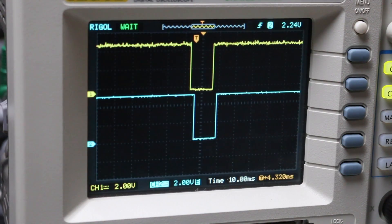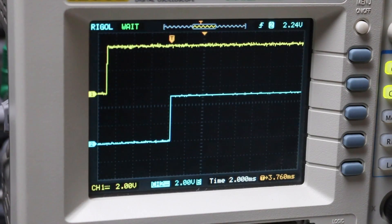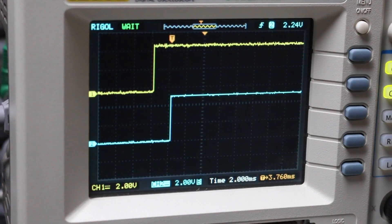I'm looking to capture a normal rotary encoder switch pulse without any debouncing, just to check the timing and see how bad the bounce can be. When I rotate slowly at a reasonable rate for one intentional movement, I get maybe two to three milliseconds between each edge of outputs A and B, or longer — sometimes six or seven milliseconds. If I rotate more quickly to do two or three rotations, I still get around two milliseconds between rising edges or falling edges, sometimes just over one millisecond. Even going ridiculously fast, on average there are still about two milliseconds between rising edges.